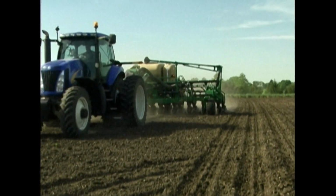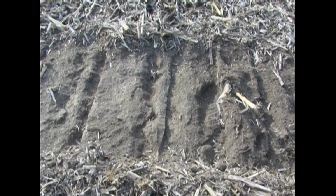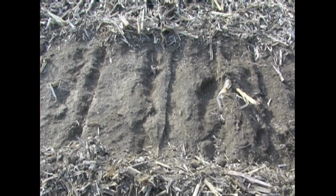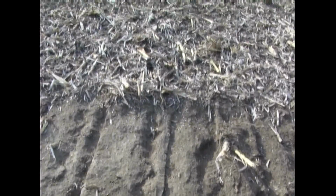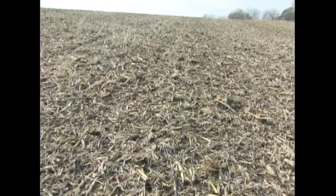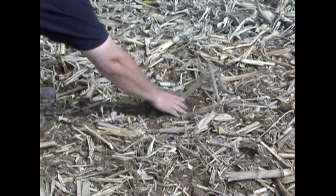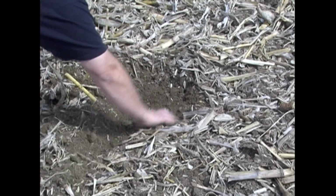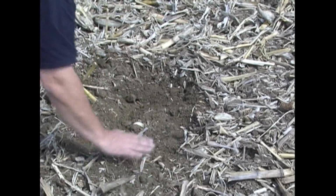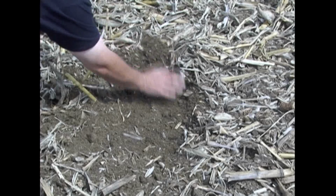When we pull the soil back, you will see grooves and valleys that create a rumble strip for your planter to ride on. The result is an uneven stand. You will also see the uneven surface and bunching of surface residue. On the TurboTill and TurboChopper, however, you will see a well-prepared seedbed with a smooth bottom to ensure smooth planter ride and great seed placement.